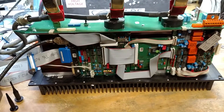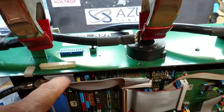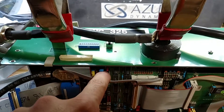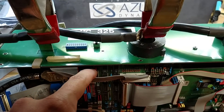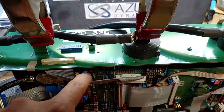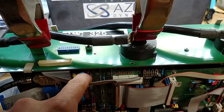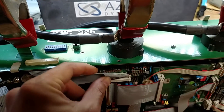I put the old boards back in and did some probing around on the encoder decoder. We've got a little hex inverter here that the encoder signal comes through — it gets signal conditioned, actually goes through a pi filter for signal conditioning, then goes into the hex inverter. It makes its way over to this cable, which was the one that happened to have that pinch in it.